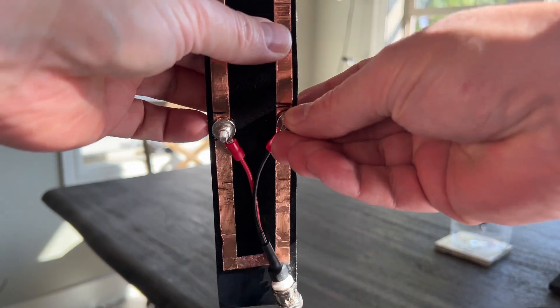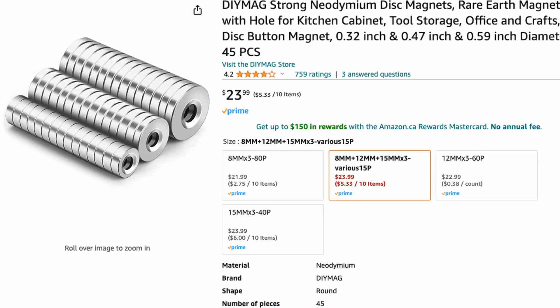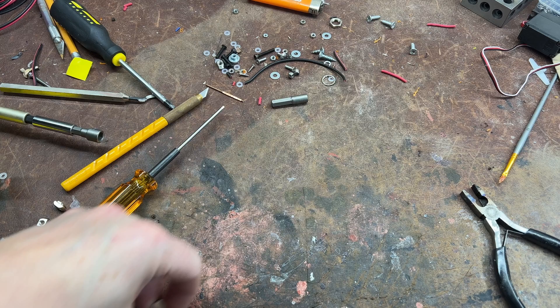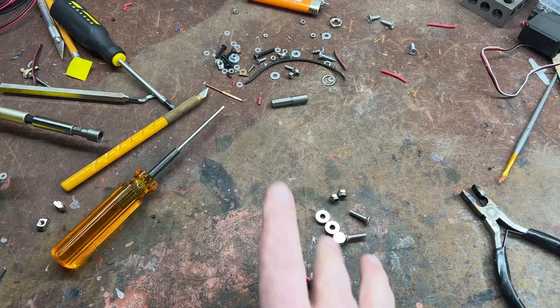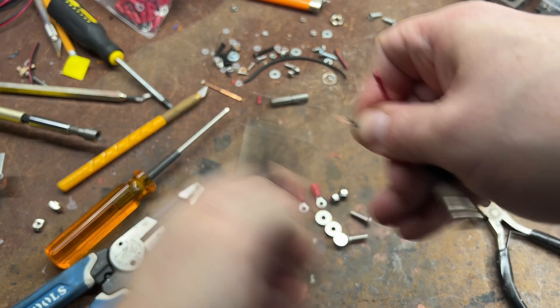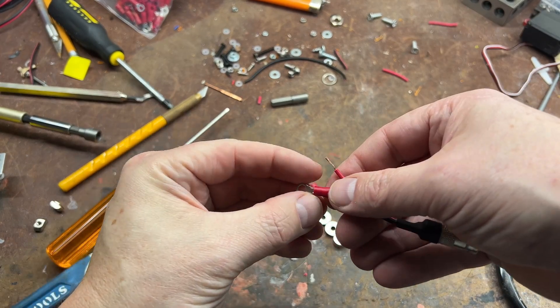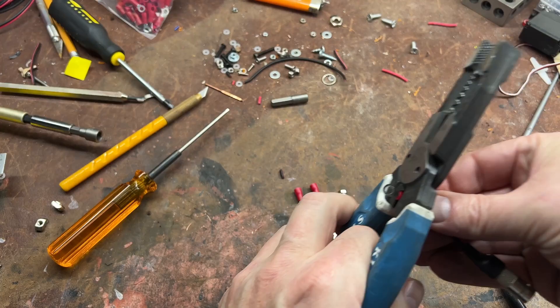Paul the Lefty asked where I got these magnetic feed points — I made them, and I'm going to show you how to do that now. It's quite simple: it's just some neodymium magnets with a hole and a countersink so you can put an M4 screw through. After that, it's crimp connectors. Throw out those old thin crimp connector things and spend a couple of extra bucks on proper ones.